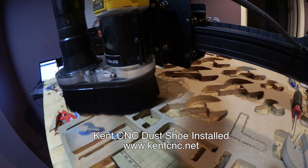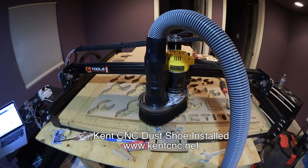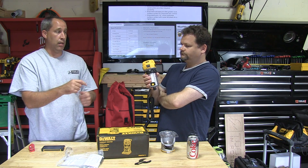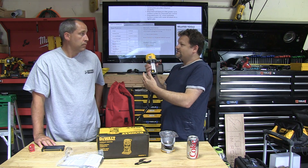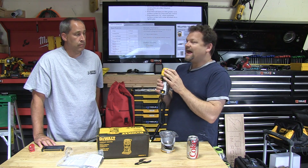On a CNC machine, you tell the program the travel speed you want — that's separate from the router's RPM. You can dial the router speed up if it's not cutting quick enough, or dial it down if it's cutting too much. With a single-flute bit running at 16,000 RPMs, that's half the speed, so you're making half the cuts compared to a two-flute. Sometimes you don't need higher speed — and higher speed is loud and harder on the router.